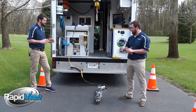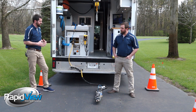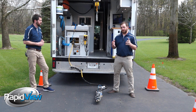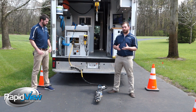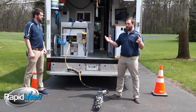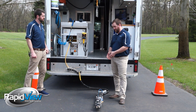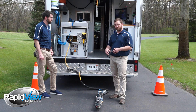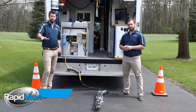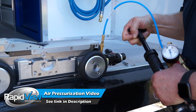As far as keeping this cutter pressurized — a lot of people use nitrogen or CO2 cartridges — how do you keep moisture out of this system? iBlock pressurizes all their units with just regular air. It looks like a regular bicycle-style pump with a dry air filter on it. We draw moisture out of the air from the atmosphere and then add one bar of pressure to the internal body of the system, so there's a positive pressure on the inside and water won't get in and damage the investment. There's also a spotlight video that covers how we pressurize all of our systems.